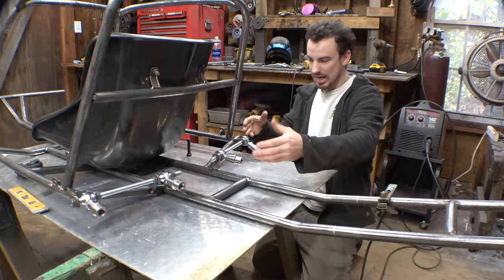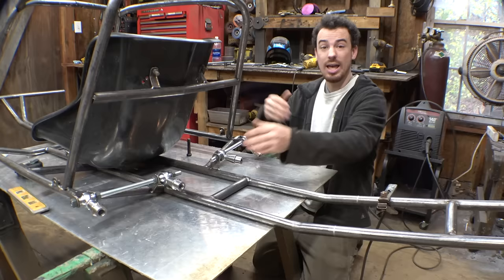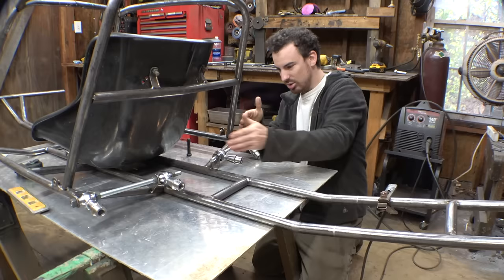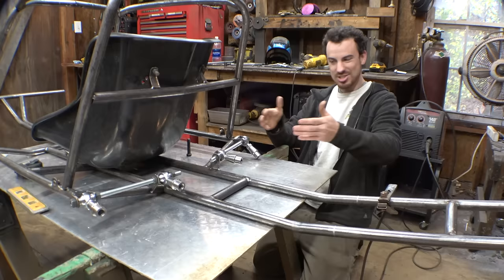I've also seen some videos of people calling four-link suspension trailing arms, so it's like, well, what style is this? And I couldn't find any information on the angles, so basically I'm just looking at pictures on Google, trying to see. It looks like they're at an angle, roughly 10 degrees, it looks like they're level, so I basically just copied that, so hopefully this is correct. I put these level at 10 degrees angled this way. So, yeah, hopefully this is correct.